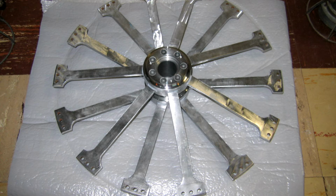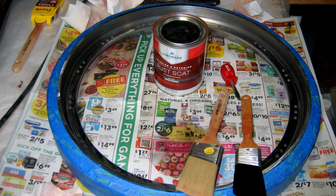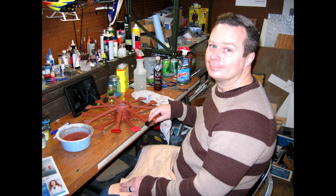To aid reassembly, we placed tape on the tire and marked the area that lined up with the oiler tube hole in the hub. This way, we could be assured that the spoke and hub assembly would be mated with the rim in the exact same orientation later on.